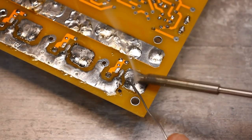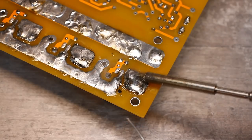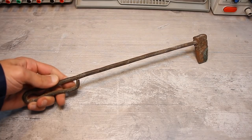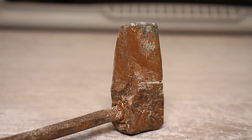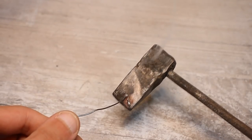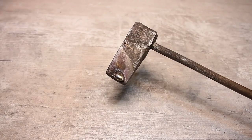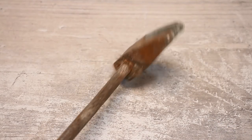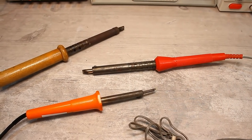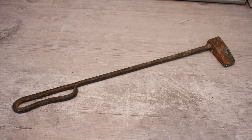As we know, the most popular way to connect electrical components is soldering. A soldering iron is a device that heats solder to the melting point. The device is universal — it is used for both mounting and dismounting of components. The first soldering irons were a handle with a copper bar at the end. The bar was heated over an open fire, and due to its high heat capacity, kept the temperature for a long time. Such simple soldering irons were autonomous but inconvenient due to the massive tip. If you decrease its size, the heat will quickly be transferred to the environment and the soldering time will also be reduced for one heating cycle. When electricity came to all industries, soldering irons became electric, although such primitive soldering irons are still sometimes useful if nothing else is available.